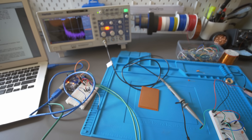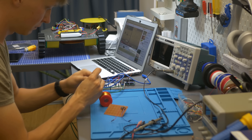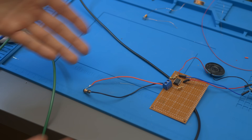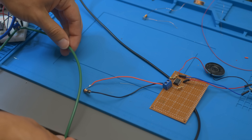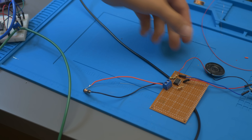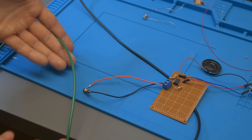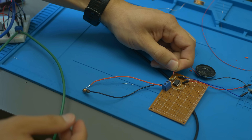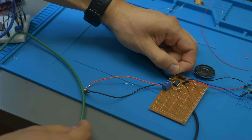Some people complain that I'm not an engineer because my desks are too clean, so here they are — not clean — and I'm working on the generator circuit, trying to figure out what's going on with an oscilloscope. I even tried making my own coils, which didn't work at all. I thought: this is an amplifier, this is an inductor, and I'm detecting a frequency in this perimeter wire cable. So if I simply connect a very small speaker to that, I should be able to hear the signal. In this case it's just a 5 kHz square wave. Now if I connect the speaker to the amplifier and move the perimeter wire really close to the coil...